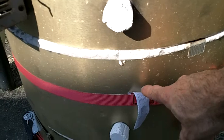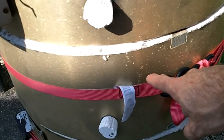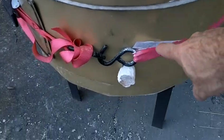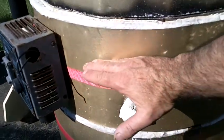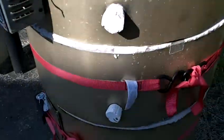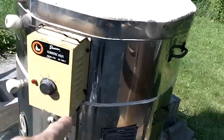These updraft kilns are a cone off as you go up, so in the center I put in a cone six. My glazes can go from cone five to seven — six in the center, seven on the bottom, and cone five on top. So I try to cut it off right here and put in my baffle tile. That's my little Amaco updraft.